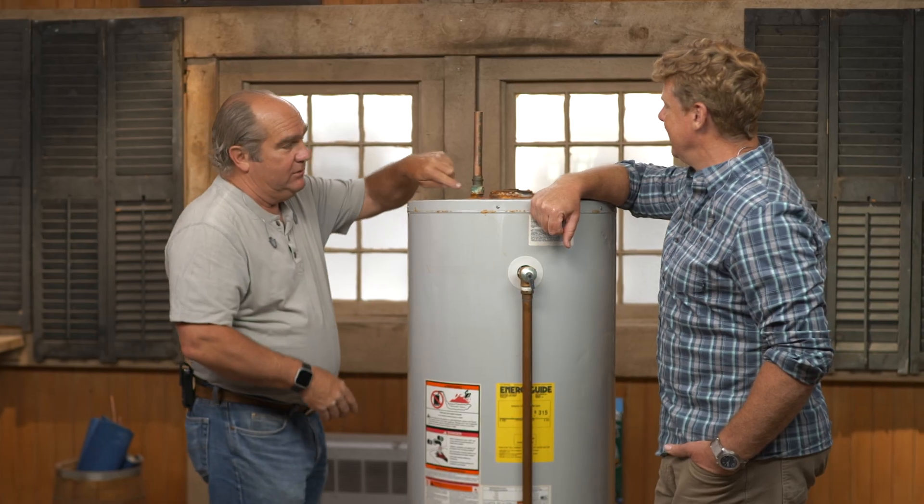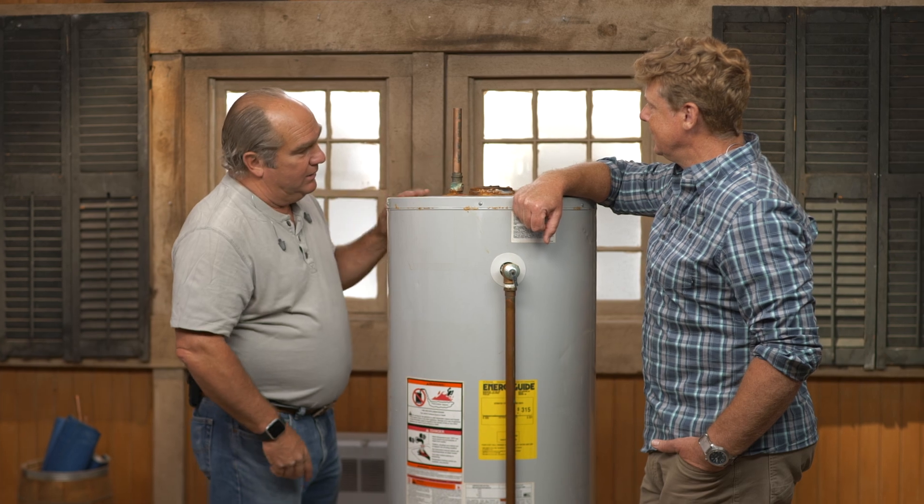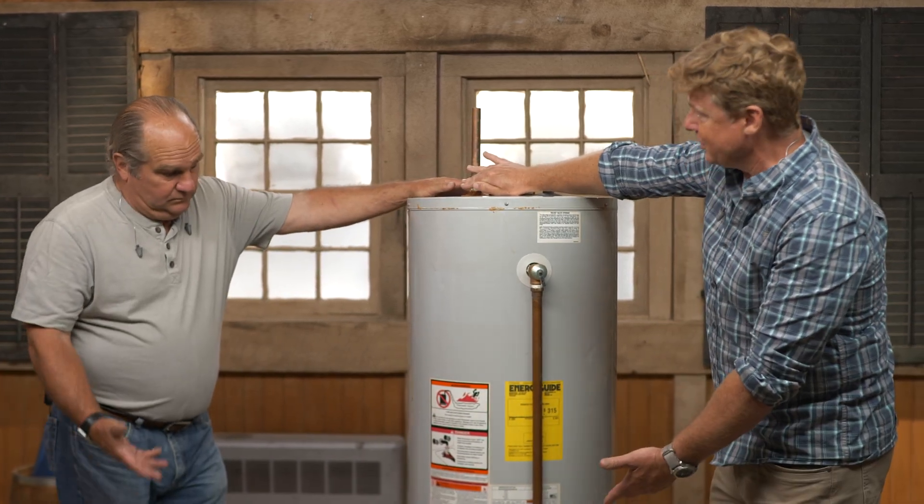You don't like the whole steel and water together. Well, sooner or later water can get to the steel and it'll rust. You can see indicators here that it leaked at the flue passageway. But other than this, to most people this looks like it's fine. Most people just ignore it and then all of a sudden they wake up in the morning and there's no hot water and there's water in the basement — they never proact to replacing it before the fact.